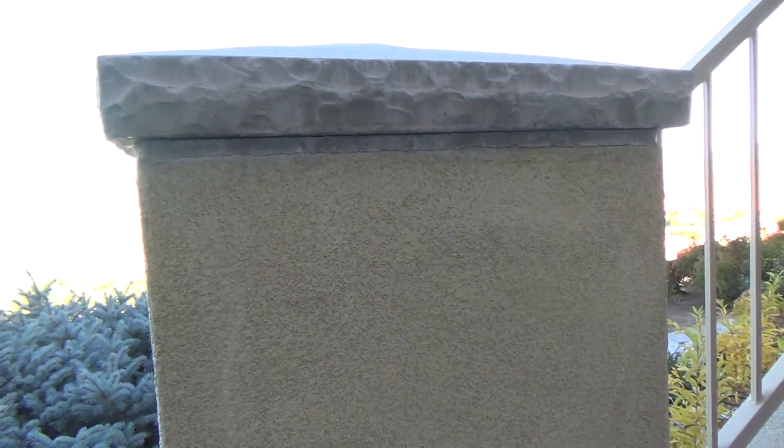Let's take a look at this side — this is the darker one. That's blending in a lot better. To get that result, those little black holes I was telling you about — if you put your patch material on too thick and too hard, you cover up some of those little black holes. Right in there I covered up too many of them. I should have just brushed it on the outside surface, like right in here — it looks better. But in order to get rid of the caulking line, you've got to put more sand on there and blend it in.